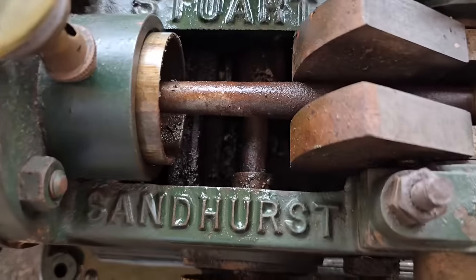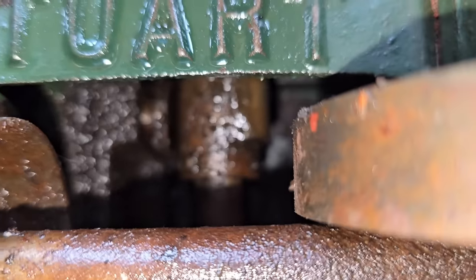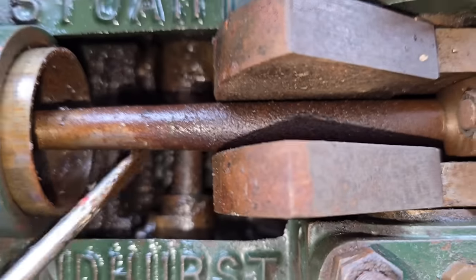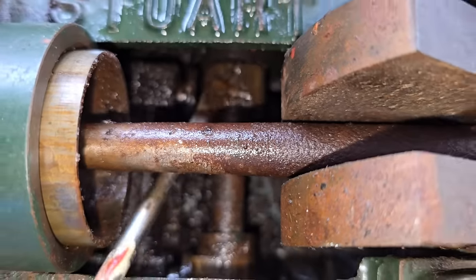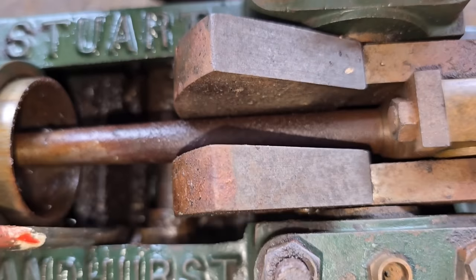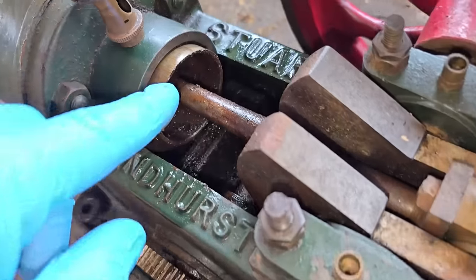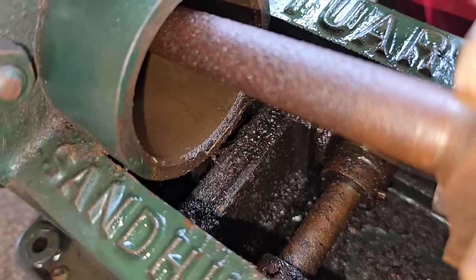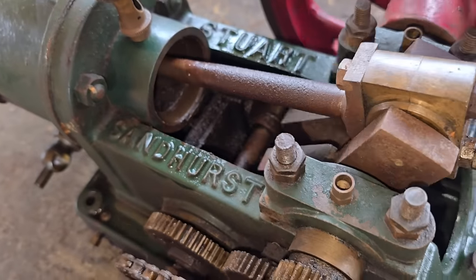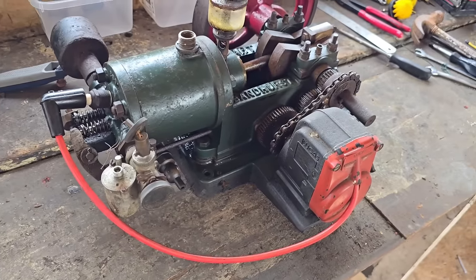I've decided that, because in there — let me turn a light on — you can see in that camshaft there, in here there's a camshaft lobe, a cam lobe there and a cam lobe there, some little lifters, and it is literally gunky in there. We're not going to be able to clean in there without disassembling this engine. I'm looking at the bore — looks a bit rusty. So I think we need to take this out and see if my cylinder honer will get in there. I think we're going to start — we will take the head off this thing.